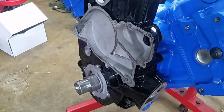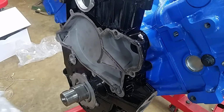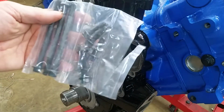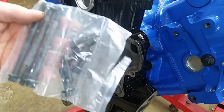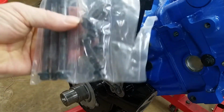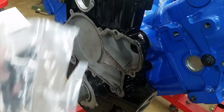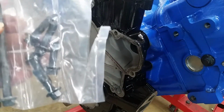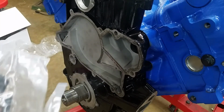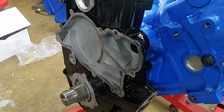So next is a water pump. So let's prepare that. To install the water pump, it takes this set of bolts. There's 1, 2, 3, 4, 5 short ones and 3 long ones. I got these from Riff Raff because the bolts I pulled out were all rusted, corroded. That's typical water pump crap, so I don't even remember how much they were. They were under 20 bucks, I think. And if you're going to go all this effort to put this in, why not put fresh bolts in?